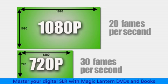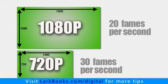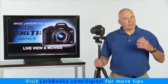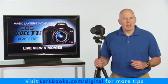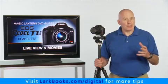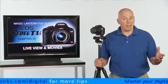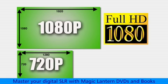so that's good. But that faster frame rate comes at the expense of image quality, because 1280 by 720 is a much smaller frame size than 1920 by 1080. Now technically 720p is still considered a high-definition image, but it is a lower resolution version of HD and doesn't offer the same stunning quality as 1080p. That's why 1080p is called Full HD and 720p is not.